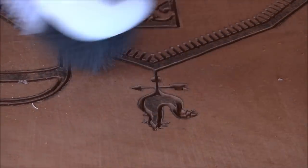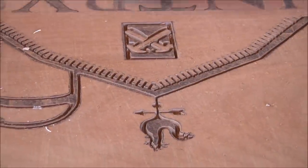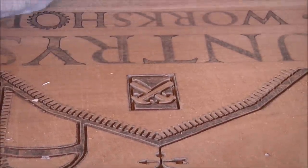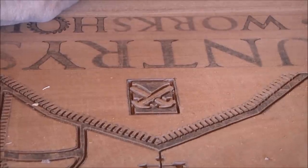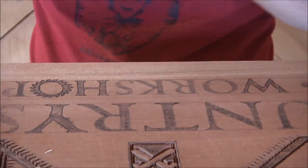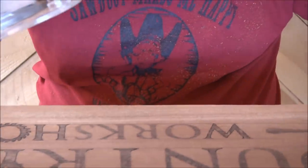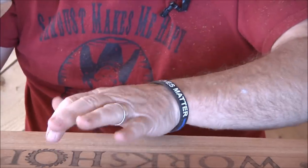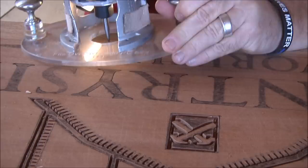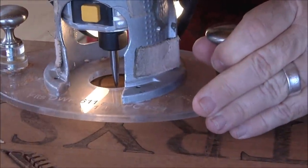Okay. So there, I can't remember whether I told you or not, but I was at about 3/16 deep with a profile bit there. So now I'm gonna back that off a little bit, maybe go more like an eighth of an inch to do my first cut on these inset letters here. Oh, actually, yeah, it's a good point. I'll go ahead and do this first with a little, what is that called? Saw teeth, yeah, that's it. Saw teeth.